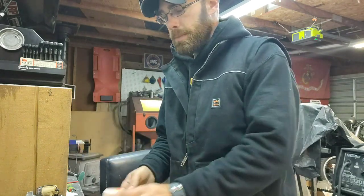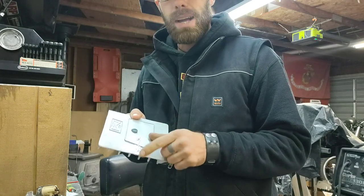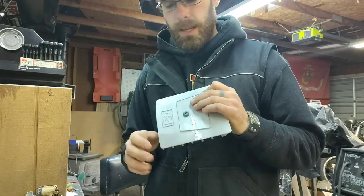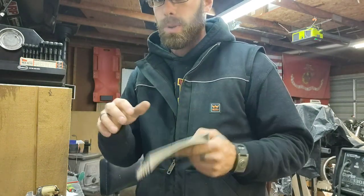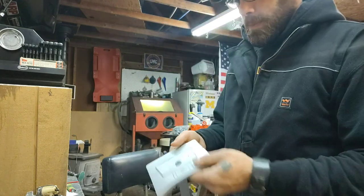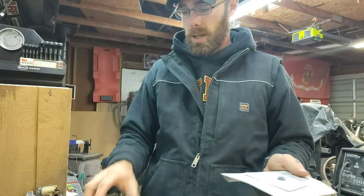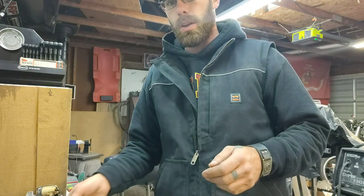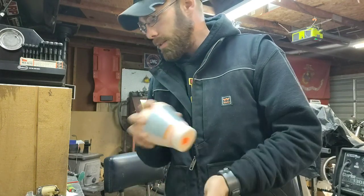So this other part — I went back through and filled some spots, some pitting that were on there. I notice it's got a little bit of a warp. I tried fixing it and ended up making it worse. Another note: when you go to do these welds and when you're putting heat on aluminum, it will warp, it will move. It's a good idea — especially with this, it's got a nice platform where you can set it down flat — to clamp it down to the table before you put your heat on it. That way it'll help with the movement, the warpage. Just a little trade trick there with welding. TIG welding would have been a whole lot better — you're able to concentrate the heat in that specific spot. I'm probably gonna go back through it with a little bit of heat, clamp it down to the table, and that'll help me straighten out that warpage.